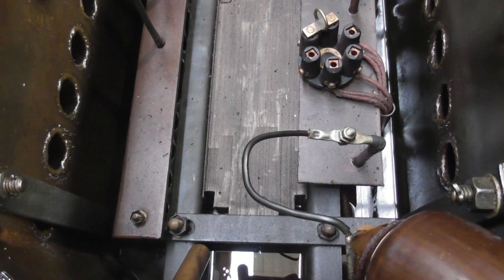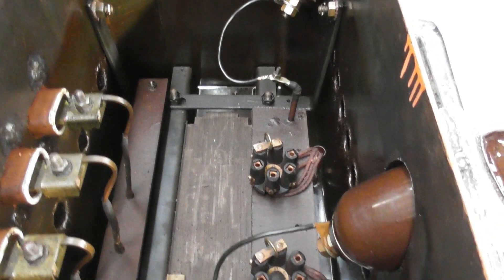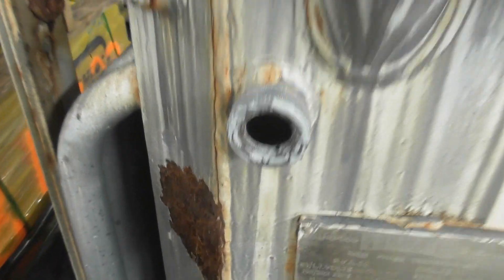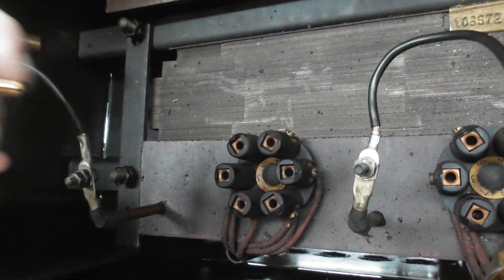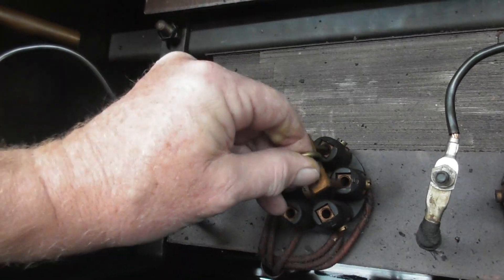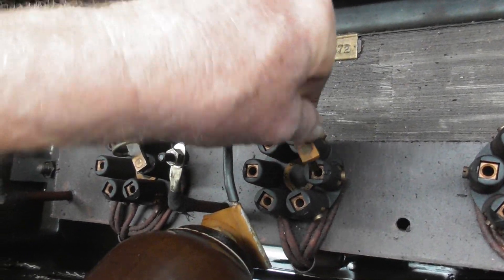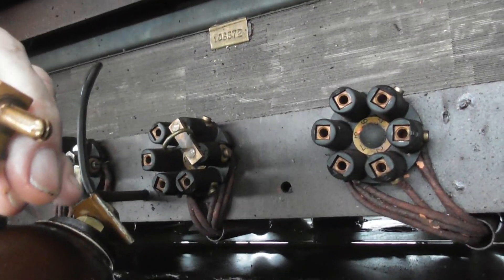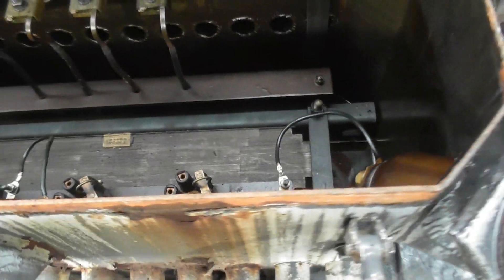The delicious aroma — this thing has had an oil leak, it's been leaking quite a bit of oil. The oil level should be up to here at least, so the side glass wasn't doing much — it's all clogged up. Still hasn't blown up. That's a really cool look at the tap changers — you need to go into the transformer to change the plugs in the oil, or drain the oil. But up the pole it's quite interesting, and the bushings are really cool too on these.